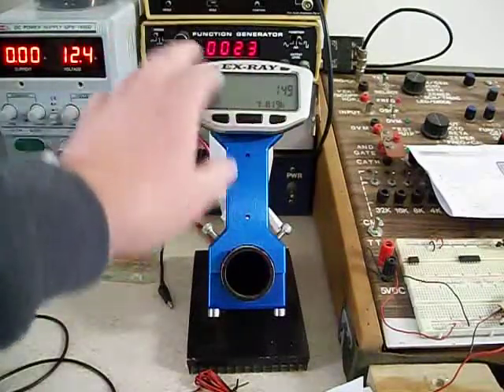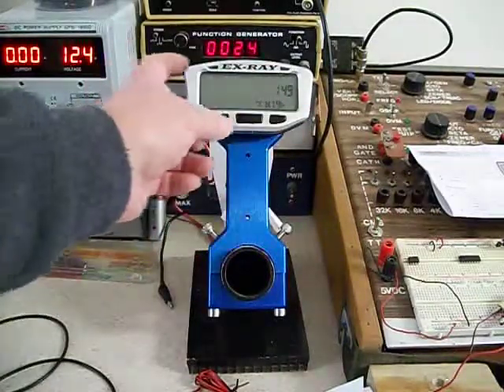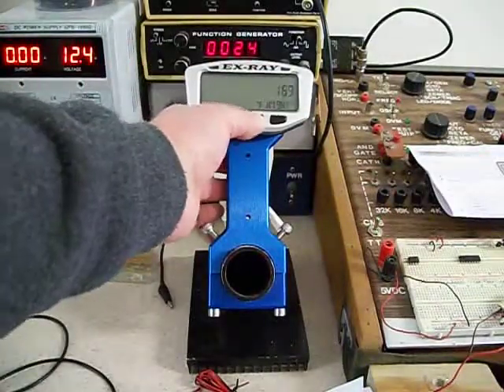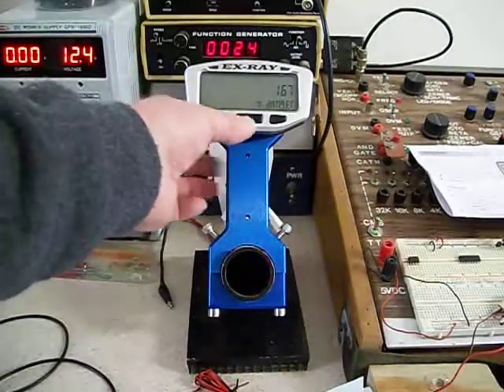For Fahrenheit high, we set the high temperature — this is where the motor is getting hot. 149°F is typical for electric motors. The danger setting is where you want to stop: 167 degrees Fahrenheit.